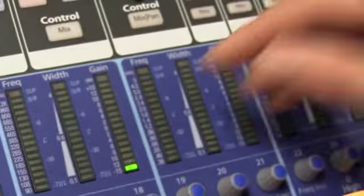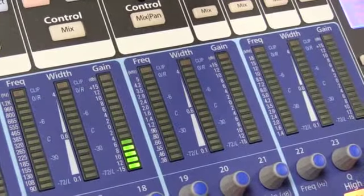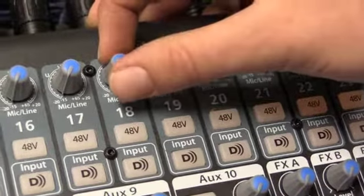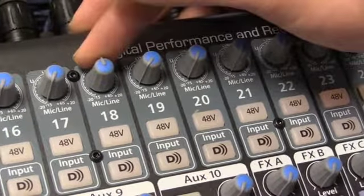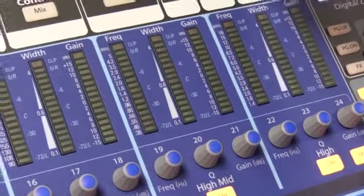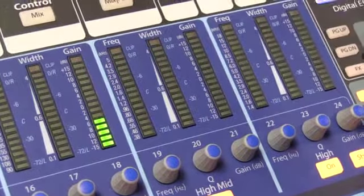I'm going to bring that up until, while I'm talking into it, it's getting up there. If I talk a little louder it shows a little more, but right where it is is fine. If your gain is being pushed up past about here, you're getting into dangerous areas — things can get way out of whack very fast. So around here is just fine. If you're getting just a little bit of signal, you're probably going to have a weak signal. Anything in the middle range will have you pretty well set.